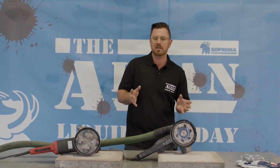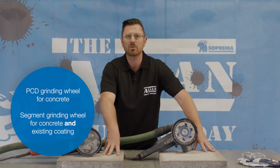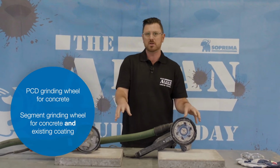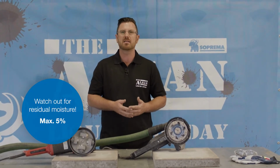Now I'll show you how this works, but don't forget one thing: if you want to work with our regular primers on concrete, like our normal PMMA primers, or even Alsan Flash and Quadro Pro, you have to be aware of the maximum 5% residual moisture.